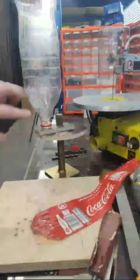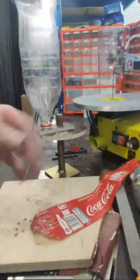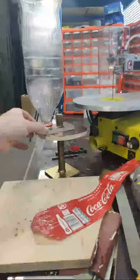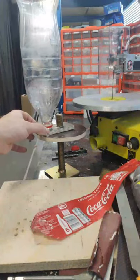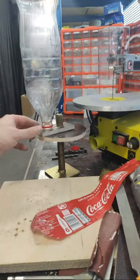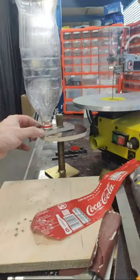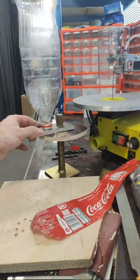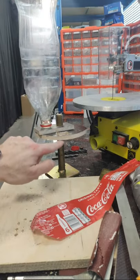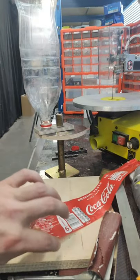So what I'm making here is a device that's going to let the food drop out to where the dogs are. So every time you play, you're going to be able to control a servo, which is going to move this slider. The food's going to drop in to that crevice that was in the slide, that disc. The disc is then going to rotate out with approximately 4 or so pellets. Then they're going to drop out of a designated spot in a chute to where the dogs are.